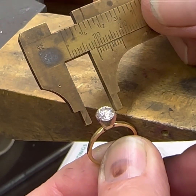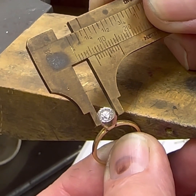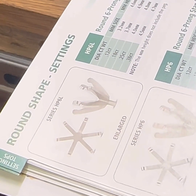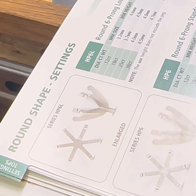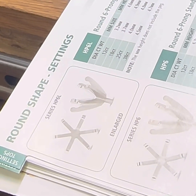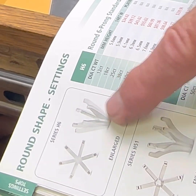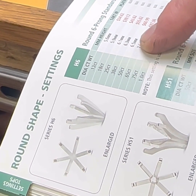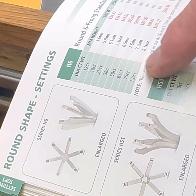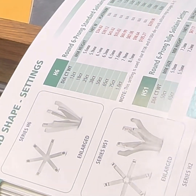So what are we going to do about it? The first thing we're going to do is measure this diamond — it's about 5.9 millimeters. Now let's go to our findings catalog. Findings are basically the parts that we order for jewelry. See that little peg on the bottom — that's a different style of setting. If you're setting it into a band, ours is this one without the peg. So I ordered this head right here for the one carat size, which is basically six millimeters, and this stone is 5.9.